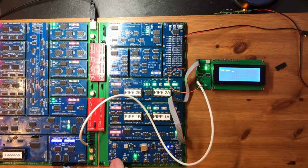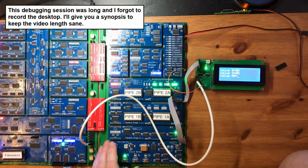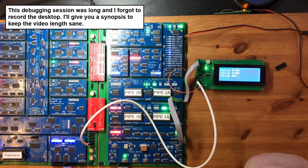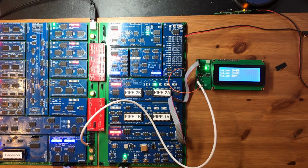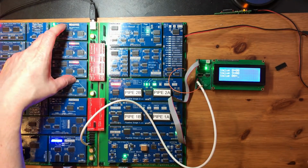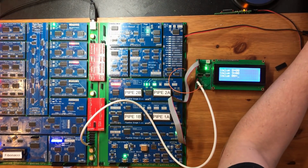So it's at value 7, which is where it goes wrong. What I'm doing here is stepping through the code several times until I work out exactly where it goes wrong. And I actually found it was calculating the Fibonacci numbers correctly, which isn't that surprising because it's just simple adds. But it was going wrong during the divides to turn the binary representation into decimal.